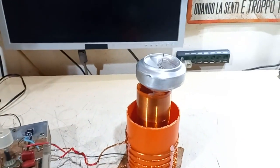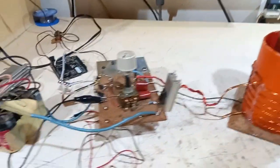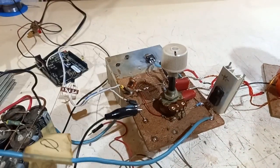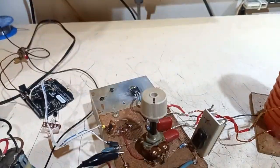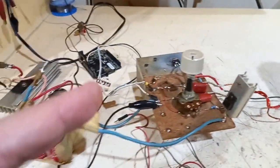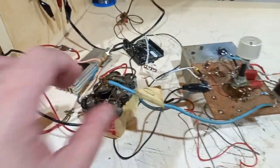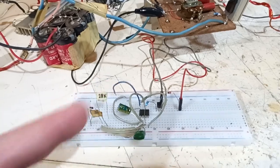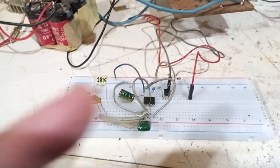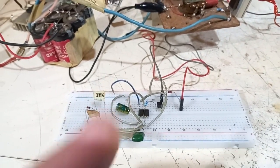I'm playing with this solid state Tesla coil — it's an old friend. The secondary is fairly small and the power here is not too high. The driver is the so-called Russian Tesla coil, or the famous MOSFET slayer exciter. I usually power this coil with the ramped DC out of a transformer with just a diode, but in this case I'm using smooth DC with a full bridge rectifier and capacitors. There is an interrupter circuit with a 555, running at 500 Hz with a duty cycle of about 12%.